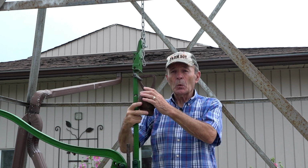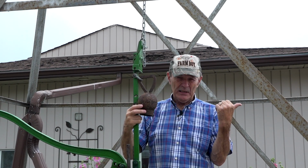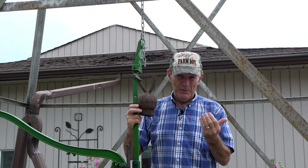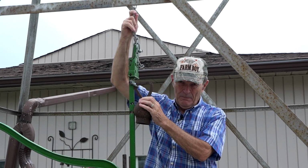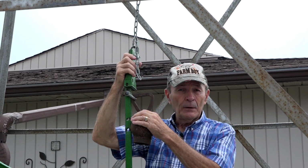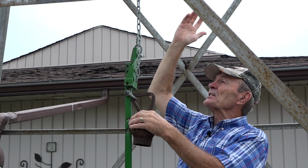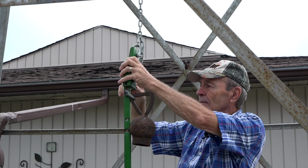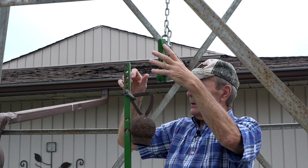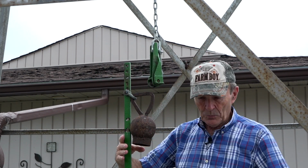And there you go. So rather than that wooden pump rod that you've seen on my windmill previously, and that you've seen on most windmills, in fact, every one I've ever seen, I have never seen a chain before. We now have a chain on the windmill, and it's beautiful. It works beautifully. It's flexible. I don't even have any guides on it. It just hangs down there and swings. When I want to take the windmill off, I pull the pin, and it hangs out of the way so I can pump the water. When I want to put the windmill on, I slide it. It works beautifully.